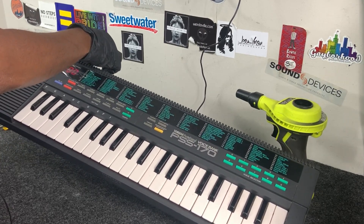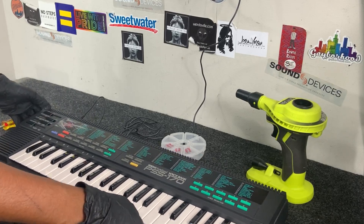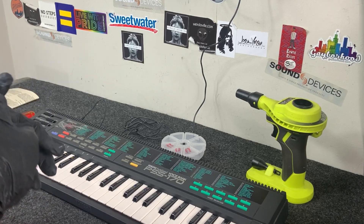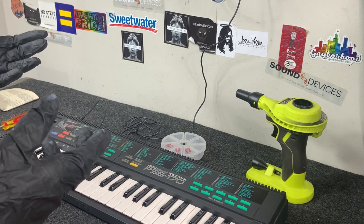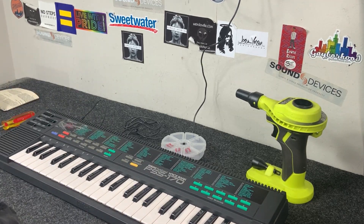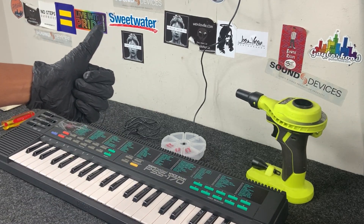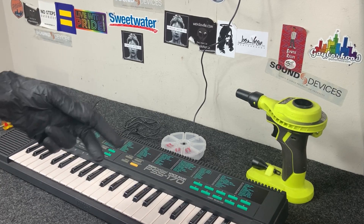Let's move the jack around — nothing. It's not cutting off, it's not intermittent. The issue has been fixed. So if you have one of these keyboards and you're having intermittent power issues, reflow the solder first, and if it's still doing the same thing just go ahead and replace the jack. If it had a cold solder joint it wouldn't have even been turning on. Anyway, I'm happy I was able to get this one repaired — another one saved from the landfill and the shredders. If you like this kind of content make sure you give it a thumbs up. Shout out to all my new subscribers and my new subscribers to come — until next time, peace.